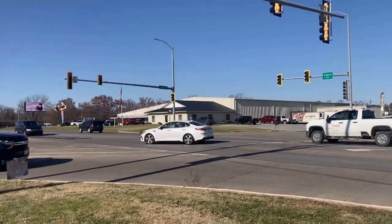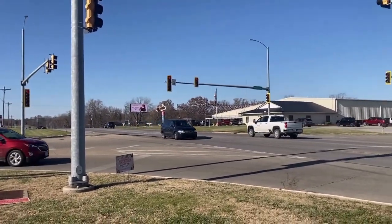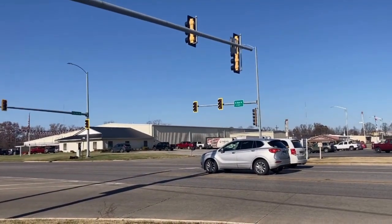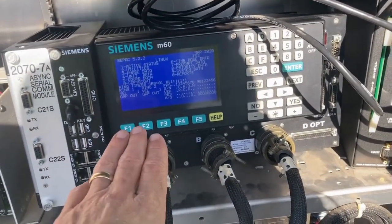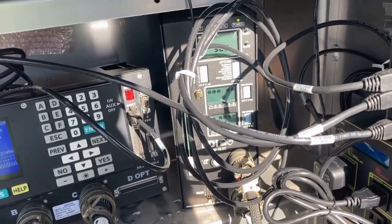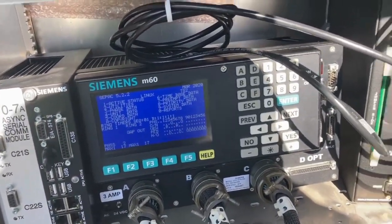We went to an all-red condition — let's see how many people keep going. They're following the signal. So we went from yellow to red, and now we're proceeding to normal operation. We'll need to set the IP address in this controller. Now I need to go to my laptop, which I had set up as the field side, and switch it to the remote side, meaning I'll be logging into the server.